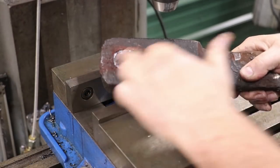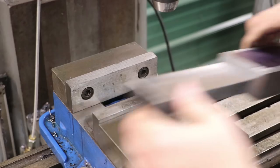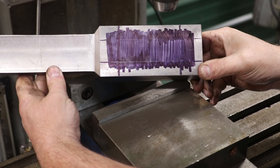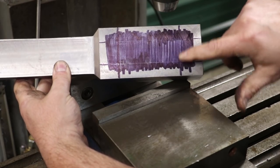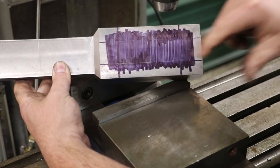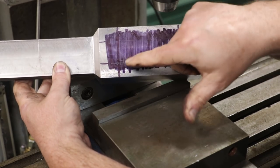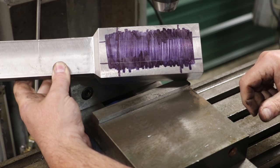So the first slot we're going to be cutting is this large slot down here in the bottom. And I've already got the measurements and so forth on there. And I've actually got that rectangular area just scribed out on here for me to have a guidance to go by. And we're going to start, because this is not a round, this is kind of a flat bottom, we're going to drill 4 1/4 inch holes in the corners that will become our radiuses. I think I'm going to then come in here with a big drill bit and try to drill out as much of that material as I can. And then of course we'll be coming in here with an end mill to go around the outside and clean that thing up so that we have a nice surface to get into.